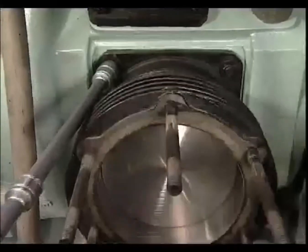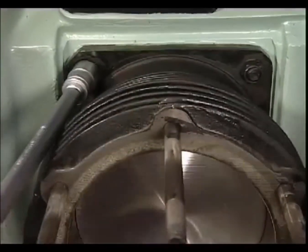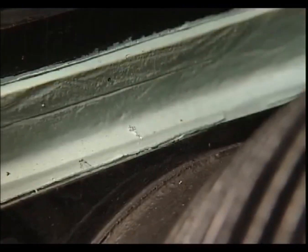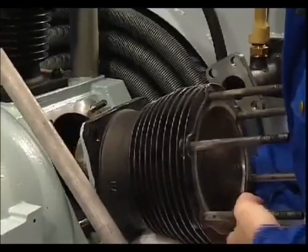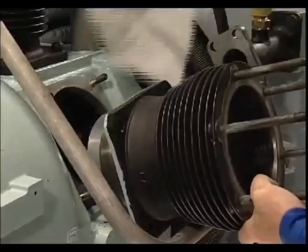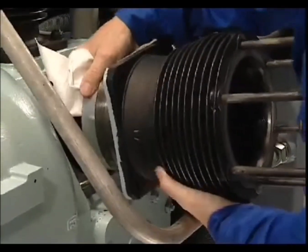To remove the cylinder, first the cylinder base nuts must be loosened. A small mark ensures the correct position for the cylinder during reinstallation. When removing the cylinder, the piston must be rotated to the bottom of the stroke — lower dead center — and has to be held in place securely, so that it does not strike against the crankcase or the threads of the studs. Take great care during maintenance never to cause damage.